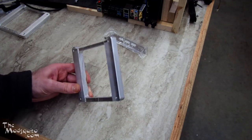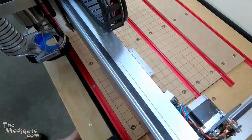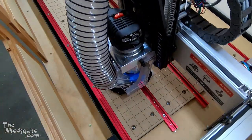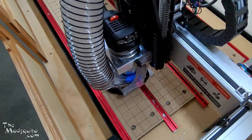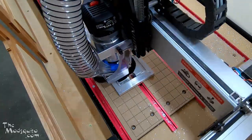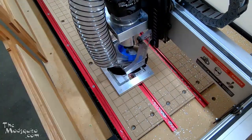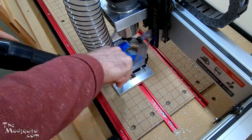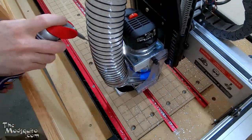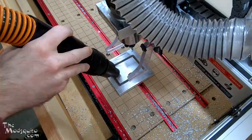Now I think it's time to take my last chunk of aluminum and make a better looking one. I start with an eighth-inch end mill to make a little recess for the four screw holes I'll later drill and tap. Then I put in a single-flute aluminum cutting end mill, quarter inch, and do an adaptive clear to make a pocket, followed by a contour around the inside. I was having an issue clearing chips so I started using WD-40 to keep things moving.